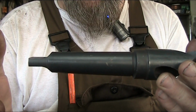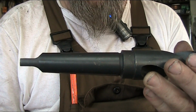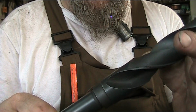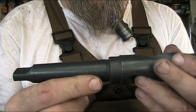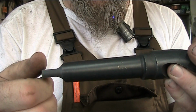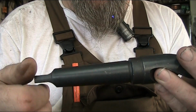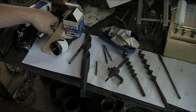Now this is a Morse taper shank. You just pop your drill chuck out and pop this in place in a drill press or in the lathe in the tailstock. So this uses friction right here to fix this in the spindle, and this little tang back here usually can double as a driver, so to speak, if this were to slip in the Morse taper.